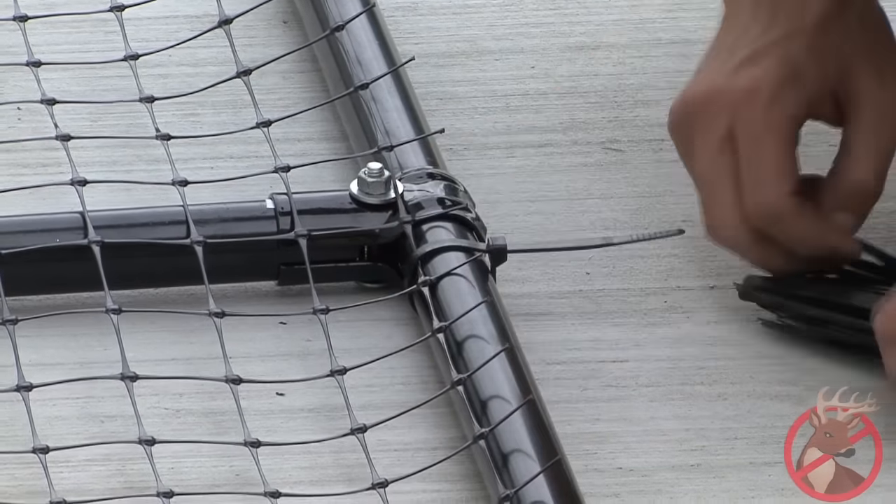On the side of your gate, measure 18 inches from the top and 18 inches from the bottom. Attach one female hinge at each 18 inch mark using the nuts and bolts provided. On the opposite side, attach your gate latches, making sure your gate latches are 18 inches from the top and bottom. Attach using the nuts and bolts provided, with the padlock hole on the latch at the bottom. Attach the male hinges at the appropriate heights on your gate frame using the nuts and bolts provided. The gate is now ready to hang. Line up the female and male hinges and hang the gate onto the frame.